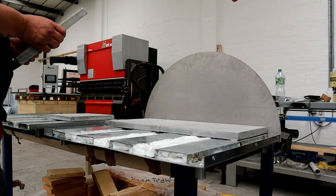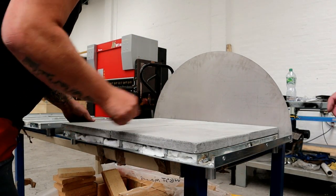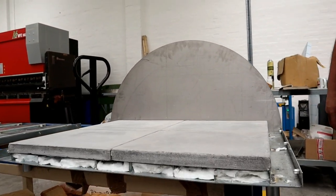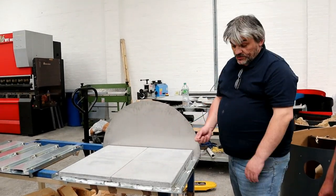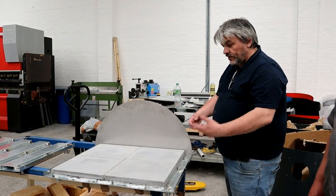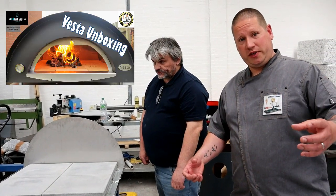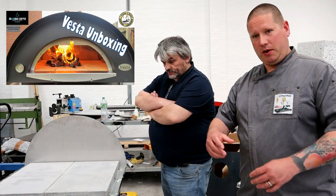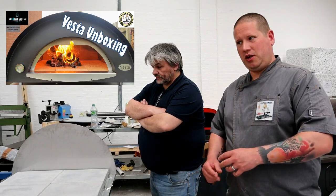Billy's putting this together. It's quite simple — we use the tiles because if you ever get a crack in a tile, they're quite easy to replace. These are refractory slabs and the material is what I call LC1600, which is suitable up to 1600 degrees, and 25mm thick — which is a lot thicker than a lot of other brands, which are 10mm thick slate tiles. For those of you that have seen the unboxing video of Skillcraft's Vesta, you'll see it's got bricks, so it might be good to do a video on upgrading your base from brick to tiles.